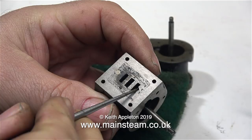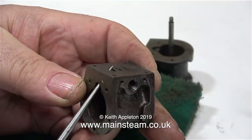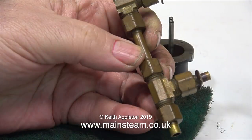Forgetting the fact that this is scrap because the ports are drilled in the wrong place — as you can see from this clip, this cylinder is in my opinion scrap. Even though the internal parts of the engine are not visible in the photograph, the exhaust pipe assembly would have been very visible, and that would say to me: the engine looks quite well made, all the studs line up okay, the machining standard looks good from the photographs — so why is the piping so horrible? An educated guess: two or more persons worked on this engine, and the first one was good, but the rest weren't.